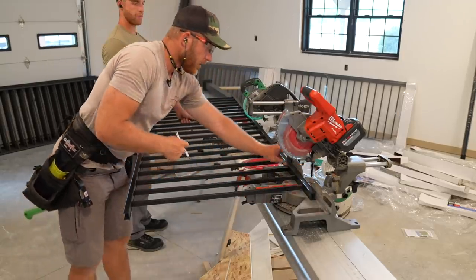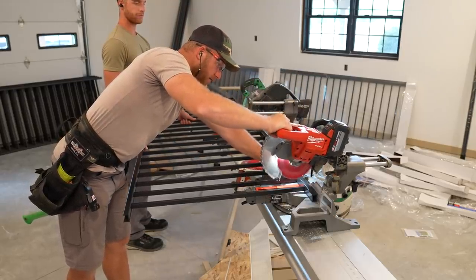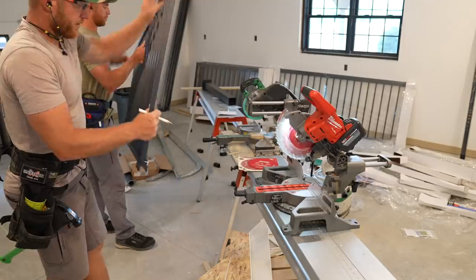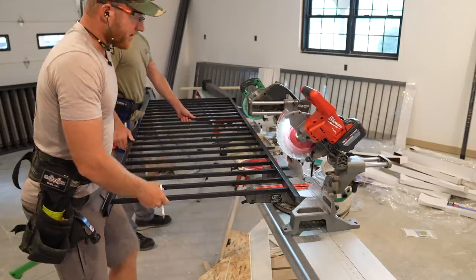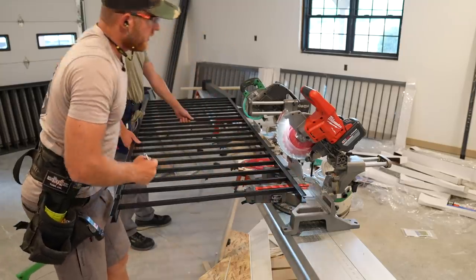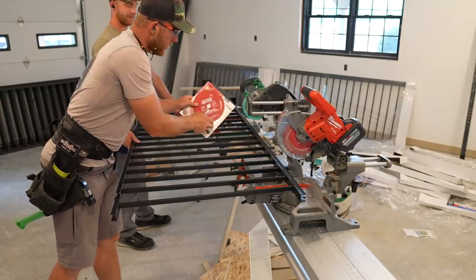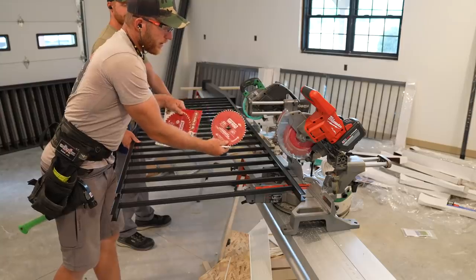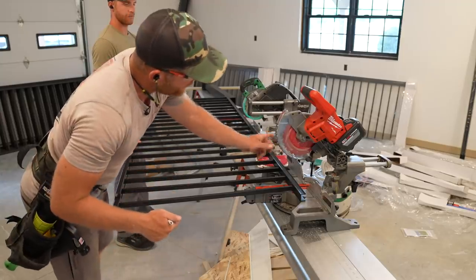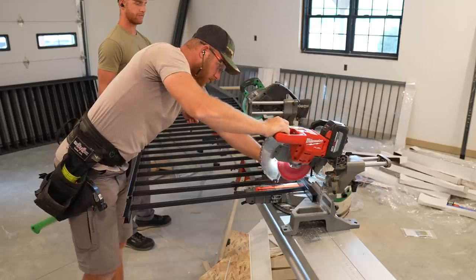And we're using a Diablo blade here to cut through this aluminum. This is so easy. Check it out. It's like no effort. I love it. I've always used a bandsaw for this, and this time Greg and I were like, you know what, let's just use a chop saw. Well, Kyle was like, let's use a chop saw. We wanted to use this steel demon blade, but I'd already used it on a rear handle saw and took the knockout out, and it wouldn't work. So believe it or not, we're using a wood metal combination blade. It's for like demolition. It's working really well.